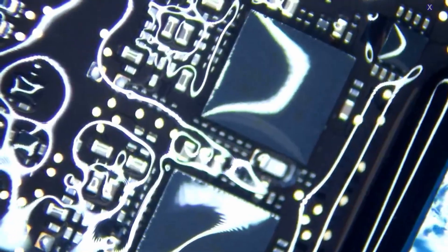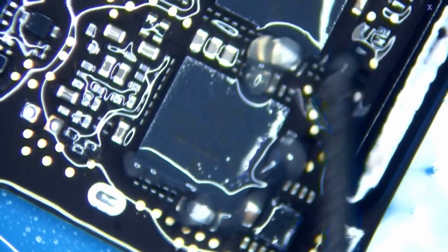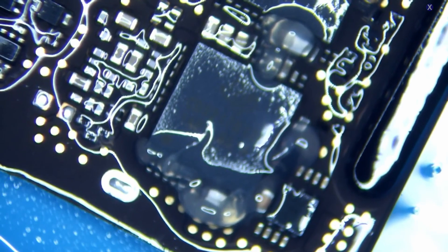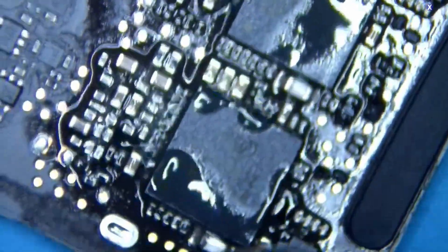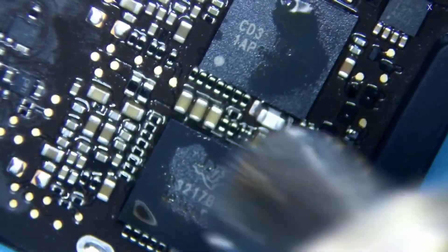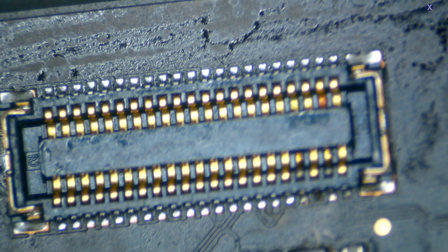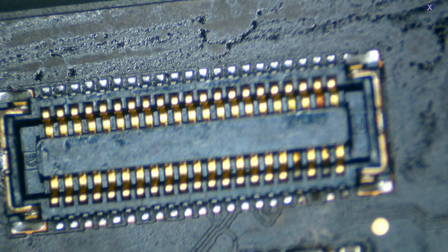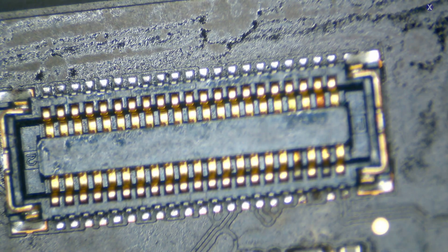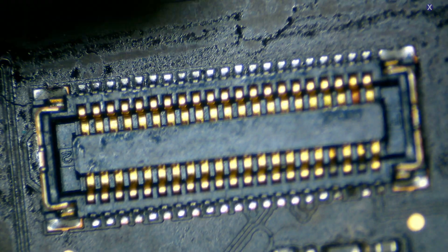We're focused on the CD32 area — that's where our charging circuit is. Before we do anything else, we want to do a reflow of it — that's going to clean underneath with hot air and some flux. We're going to do these on the most important areas first to make sure the solder is going to be good. Especially on this one, which is a BGA — that will clean underneath very well. You always want to be careful because it's easy to push dirt and debris back underneath. We come back to the trackpad area, which actually wasn't too bad — it was a little dirty but we were able to clean it up, and it didn't look to be too bad.